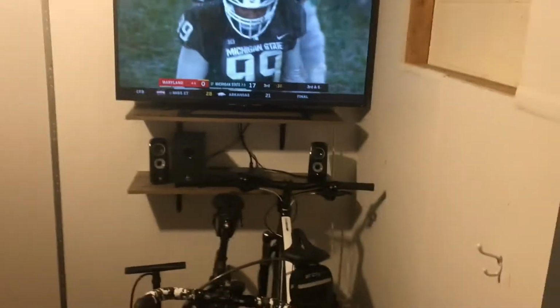So now I'm pedaling. Now that I'm pedaling it is very easy. There's no resistance really at all. I'm just getting the flywheel up to speed. So what I'm gonna do is turn my power saving back on high. That's good. My battery is on. My battery is powering the inverter. So what I'm gonna do is turn on the switch that powers the field current in the alternator.